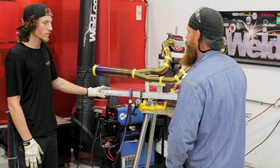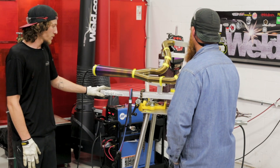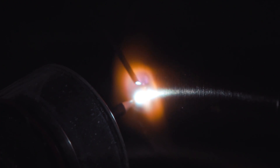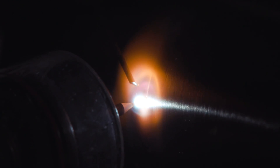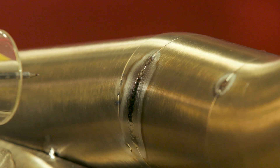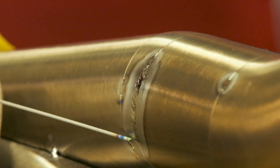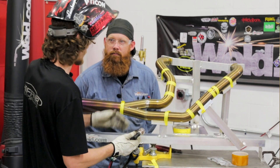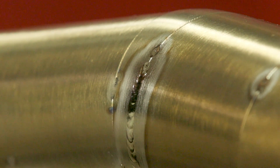So you're definitely looking for a silver final weld versus the purples and blues — correct. Now that she's purged out we're gonna go ahead and start welding, right here, going up with it. You'll see there was a moment where the wire got hung up — if you don't keep it in that puddle it sticks and doesn't like to come off. You really got to keep the wire in that puddle. I held the gas there long enough, let it cool, trailed far enough, and kept a nice speed so I didn't get discoloring in the heat-affected zone outside my gas lens.